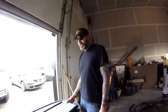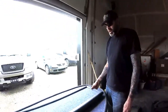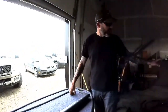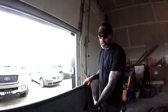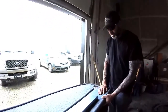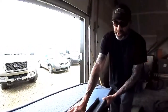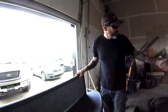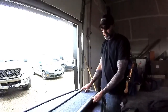All right, in addition to the floor that we made for the boat, I went ahead and put a bench into the middle here, which I'll finish off with a couple of holes and just tie to the sides of the boat. Same as the floor, I took a piece of 3/4 inch plywood, finished it off with some primer and paint on the underside here. I put a piece of 2x6 in the center just to give it a little more added support and stop it from sliding side to side when it's tied down inside the boat. Gives it a little more weight and stability.